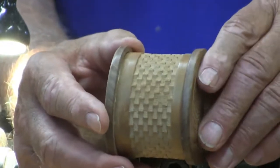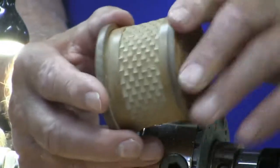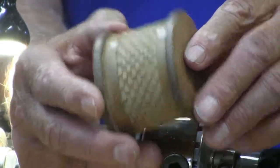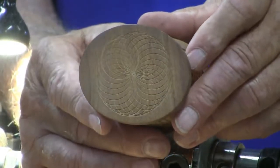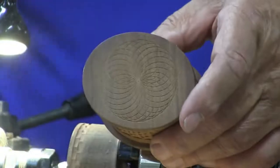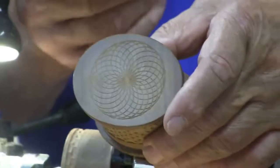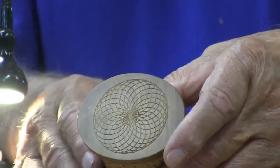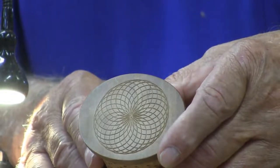If you hand this to an ornamental turner, they'll say, well, blah blah blah, it's off here. But if you give it to someone who's not an ornamental turner, they'll say, this looks pretty nice there, Daniel. And this on the end here, that is a barleycorn. That takes this little tool right here, and you adjust the circle, the size of the cutter, to make those. Those are just a series of cutters, six series of cuts. There's 24 cuts in there. And it's just the same thing.